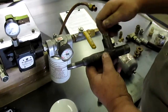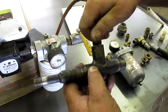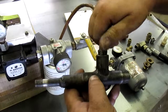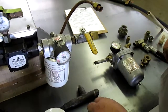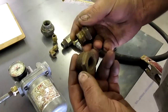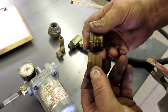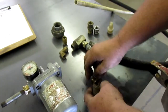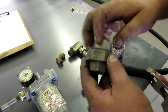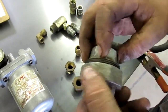This style here causes trouble — it's too long, the fitting can crack or get bent. Also, when people fill with oil, they sometimes forget to put Permatex on the plug, and that will suck air. Other issues include cheap-quality fittings, cast iron fittings with poor threads, and even some brass fittings with poor threads. Do not use a three-piece pipe union — they look like they'd work, but they suck air.